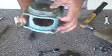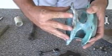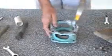We want to take this, clean it, pull these ears out. Same thing on the back. I don't know if you're aware of it, you can see it, but pulling against the motor, the aluminum end bell motors will push against these here, and what will happen is it'll bend these ears back on this side too. So we just want to take and straighten this thing out. This is where you don't have to be afraid.